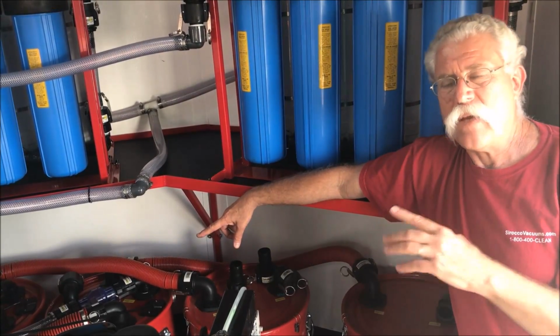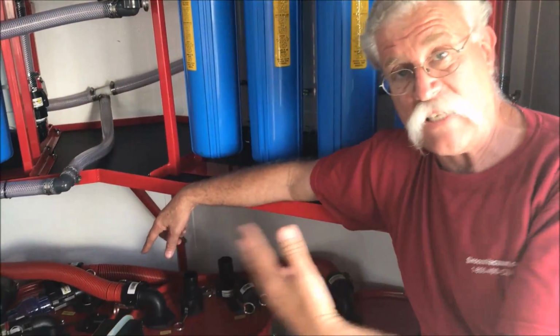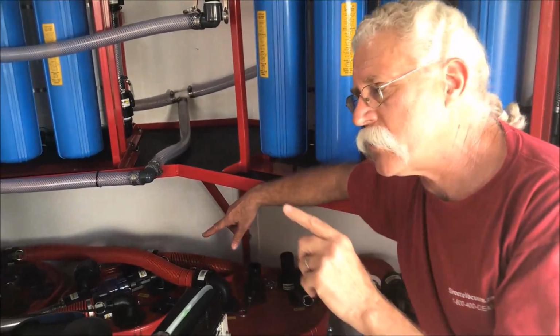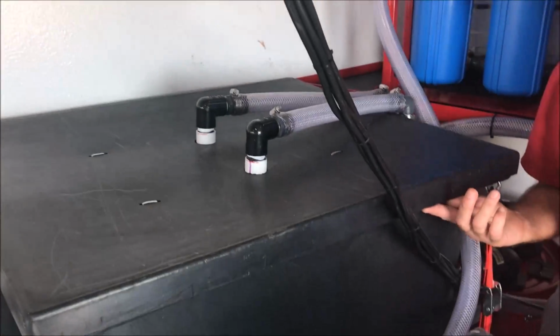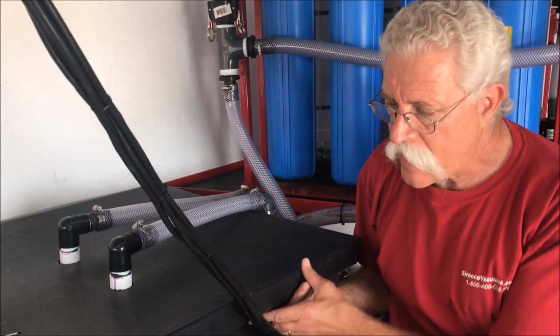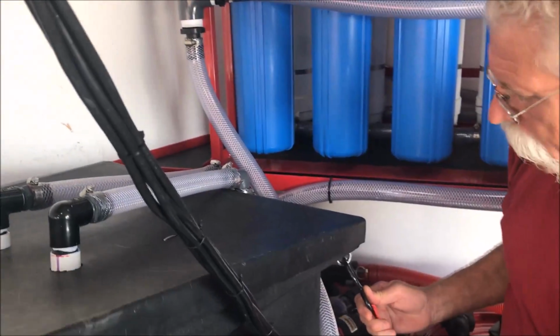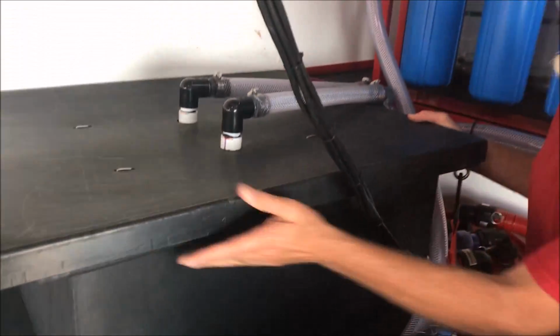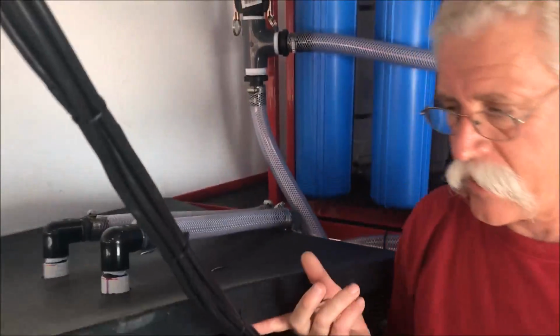In this system, because my customer wanted to be able to do parking garages, from the automatic pump outs, after all this sand and silt and debris filtration, then we go into the oil water separator, which happens to be the 100-gallon version, which has a set of 9 bag filters doubled up inside this tank. So up under here, we've got 18 bag filters, doubled sets of 9 filters, and that brings us down to 100 microns. But before the bag filters, we're dropping through what we call our adder tank, which has a set